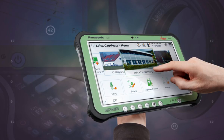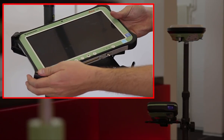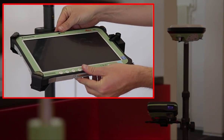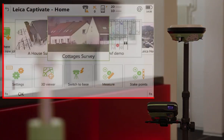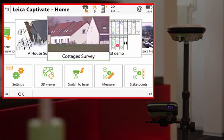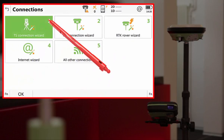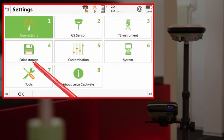If using the CS35, the mounting procedure is almost the same. The differences are that we use a different holder plate, and then we slide the CS35 into this plate from right to left before twisting the lock to ensure a secure fit. With this done, we are ready to turn on our CS device — be it the CS20 or the CS35 — to connect to our GNSS antenna, start receiving RTK corrections, and get to work. If we have used the GNSS antenna before, it will connect automatically. If not, we can go through Leica Captivate's simple wizard to establish the pairing, and also use the RTK connection wizard to establish our RTK communications.